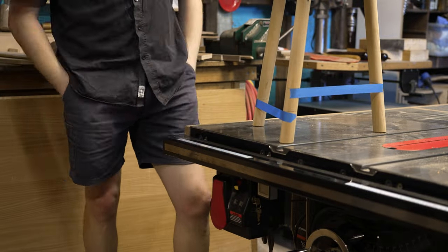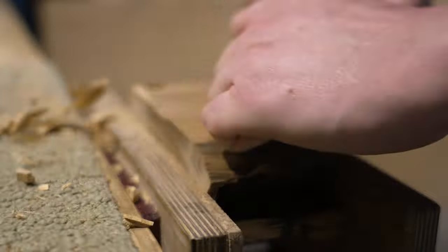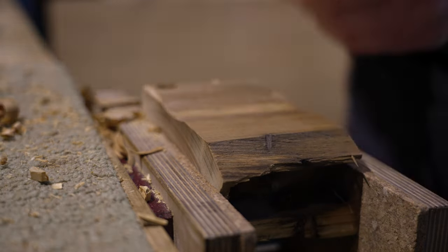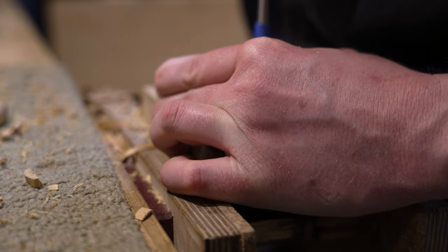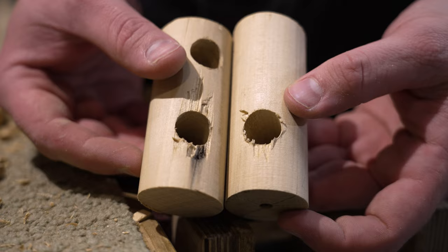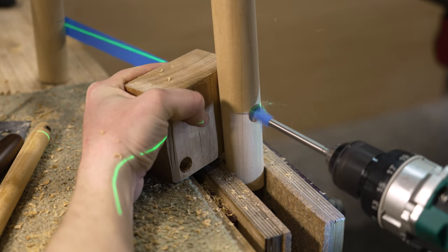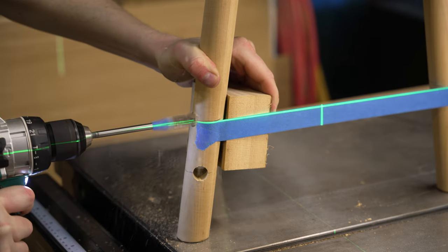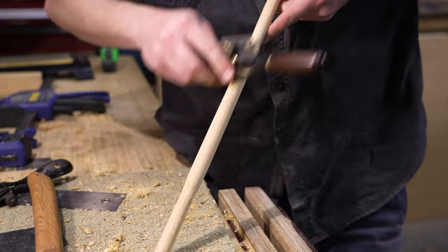There wasn't enough room in between the legs for the drill either, so I had to drill from the outside in. I was worried about blowout, so I carved out the profile of a leg into this piece of scrap and hoped that I could hold that onto the backside of the leg to compress those fibres so it wasn't going to blow out. You can see it did help — there's one on the left with no piece of scrap and one on the right done like this where I just held it behind. Just lining that laser up with the guides on the drill — I think that was probably one of the first times I've ever used those markings on a drill before. Surprisingly okay.